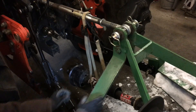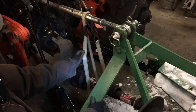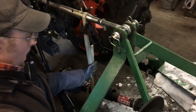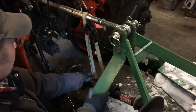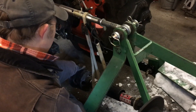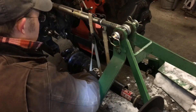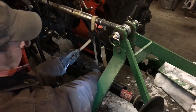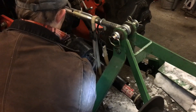Here's another use for ratchet straps. This is actually more like a cinch strap — it's a one-way device where you can pull the strap in to tighten it and it won't loosen until you push the release lever. I use this strap to hold the shaft up horizontal so there's no sideways stress on the universal joint while sliding onto the snowblower. Now connecting it to the tractor, rather than juggling this heavy shaft in mid-air by hand, I can just use the strap — pull up on it while pulling the connection down to make things easy.